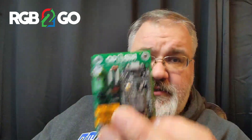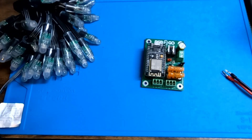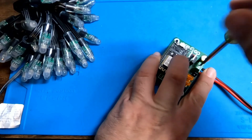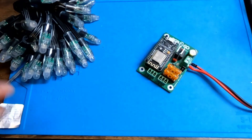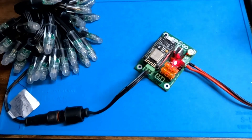We've added a bit more protection to this circuit so that if you were to plug it in backwards, not only will it not cause damage, it'll alert you to that. I want to show you what happens when you're doing too many things at once — you plug the negative and positive into the wrong ports and you're not paying attention, then plug in your lights. As I add power now, all we get is a red status LED alerting you that you reversed polarity.